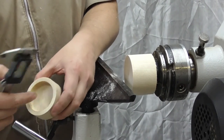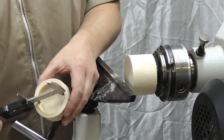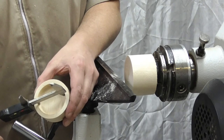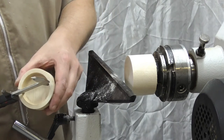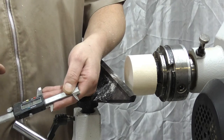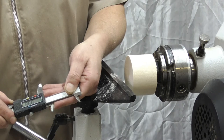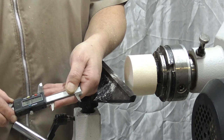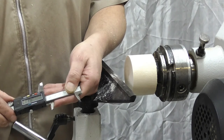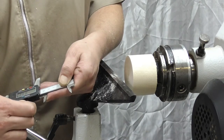I'm going to use some digital verniers to actually work out my offset. It's important that you wobble the verniers across the surface to get the maximum diameter — it's very easy to go in and think you've got it when you haven't. Carefully take that out and add the offset. For 16 TPI it's a 1.1mm offset — so on zero, add 1.1. It's different for different thread pitches; for 14 TPI you'd need about a 1.6 offset. So it's reading 1.07, 1.13, 1.08 — that's close enough.